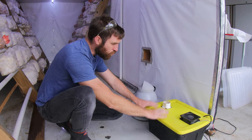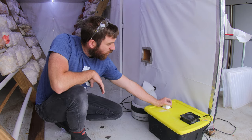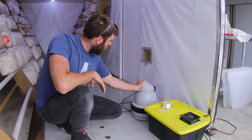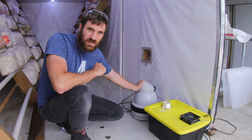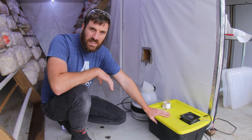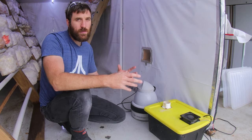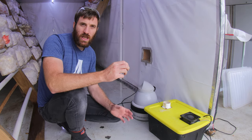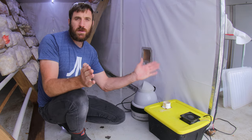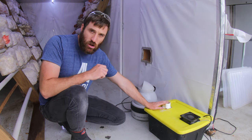We are back up and running. This has a new 6-disc fog in it — you can see the amount of fog that comes out of there, it's an awful lot, more than what comes out of the hydro fogger. The reason I've gone to a 6-disc fogger over a 12-disc is cooling. When you're in a hot, dry climate like I am, you can actually cool the air temperature a substantial amount by shifting it from its dry bulb temperature to its wet bulb temperature, so all the air coming out will be at the wet bulb temperature, which is a lot lower.